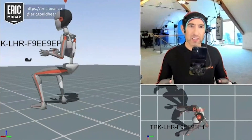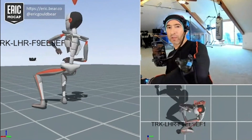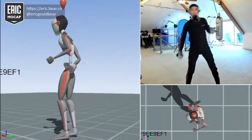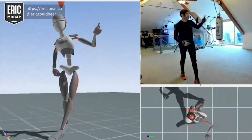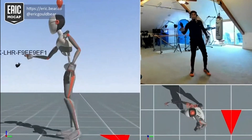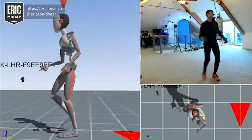The last piece of tech: with this latest version of MVN, we've integrated Vive trackers. This is a 3.0 tracker on my lightsaber. We also have one on my elbow. The MVN suit uses inertial sensors — it's filled with accelerometers — so it's relative motion and relative position, but we can get drift. Just one sensor on my body grounds it to the towers around the room, locking my position to a very specific place. And then with an object like this saber that I can toss back and forth, we now have an object that can come right into Unreal and be used in that sort of way.